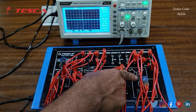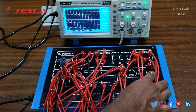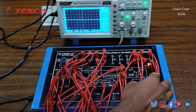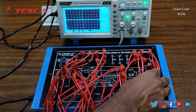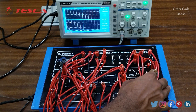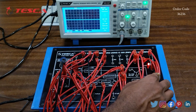After switching on the kit, we can see the LED is glowing very low. We have to rotate the 47k potentiometer to increase the brightness of the LED by rotating it in the clockwise direction. First keep it at fully anti-clockwise, then slowly rotate clockwise — here we can see the LED brightness increases as we increase the output values. When you rotate it back anti-clockwise, the LED brightness decreases. As you rotate the potentiometer clockwise, the brightness of the LED increases.